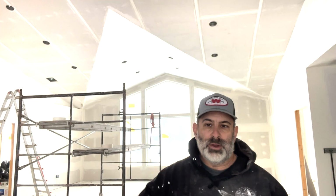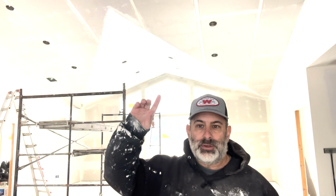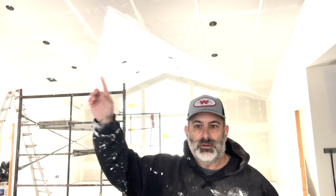Well, the good part is day one is done. Between the three of us, we managed to get 8 hours in today. So we've got about 24 hours worth of work in this house so far on day one. We went through and did all of the pre-fill with the Easy Sand 45, which is the hot mud. We got all of the butt joints filled and everything else.